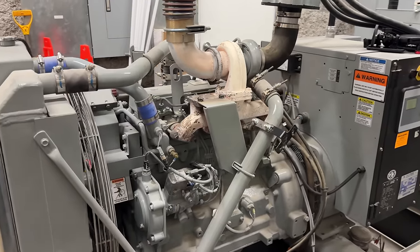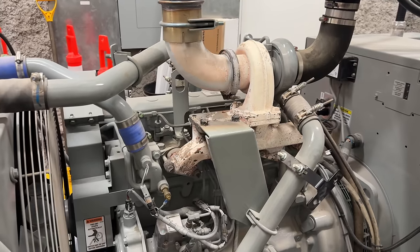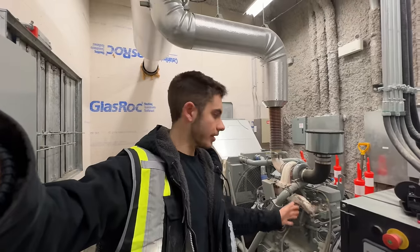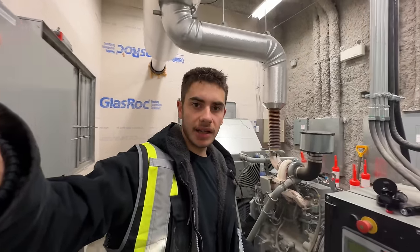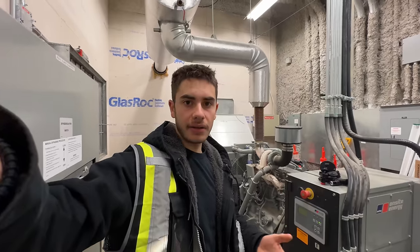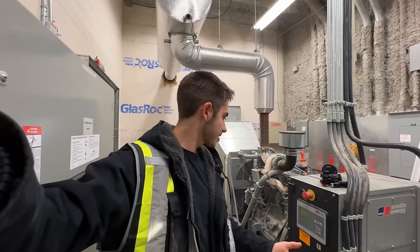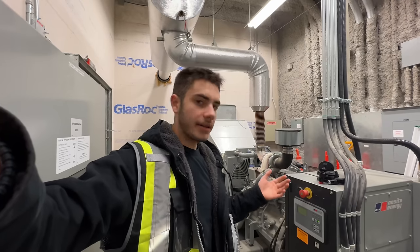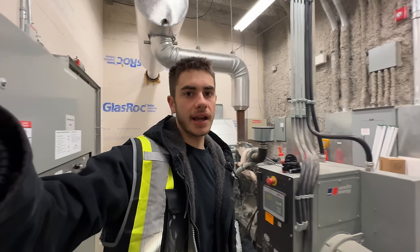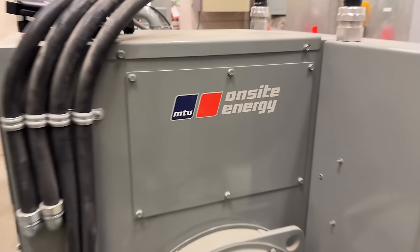This generator is powered by a John Deere inline four. It is a turbocharged diesel. We use diesel because this school needs to be able to run this whenever, and these schools are meant to be able to be an emergency community shelter. In a seismic event like an earthquake, which is a likely cause for these buildings to need to be used as intended, the gas lines will shut down, so it needs to be able to run off diesel. This is a MTU branded generator.